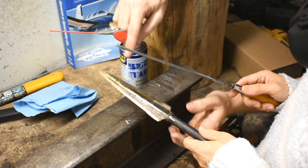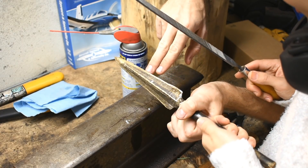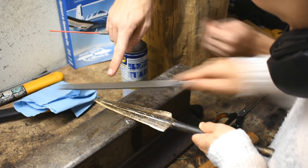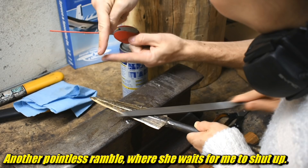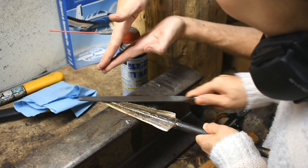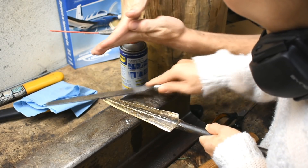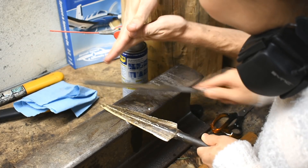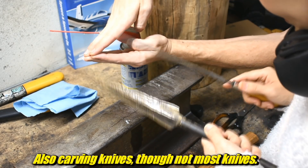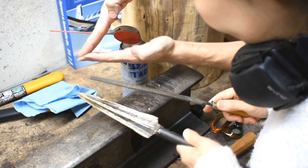Flip it around and start doing the other side — you'll see that this edge has a thickness to it, and you want it to get more like an edge. With blades, there's an angle. You can have the sharpness of the edge itself, but also the angle of the edge can be thicker or thinner. Since a lot of things are sharpened with rotating stuff, you end up with a curved bevel — a thicker thing with a sharper point, like a lot of razor blades. However, swords are more of a knife angle — still an acute angle, but a much thicker sort of edge. That's probably what we're going to end up with here.